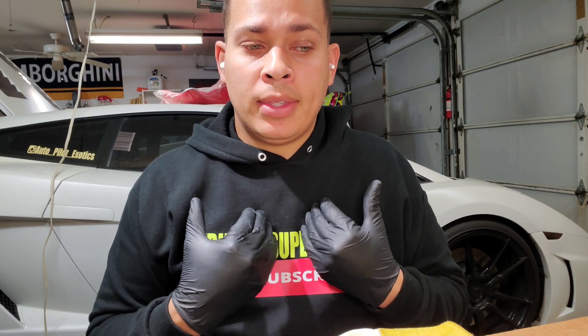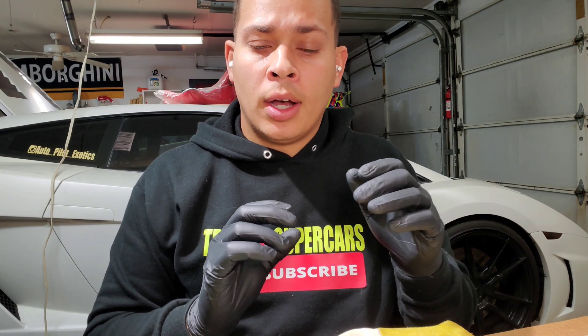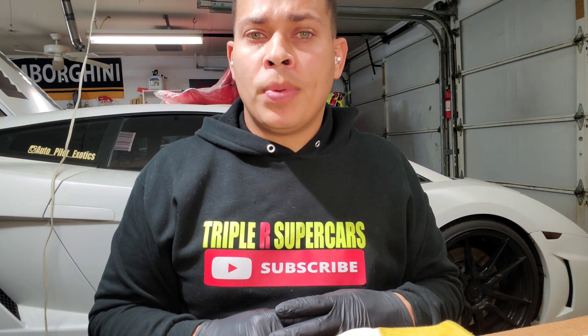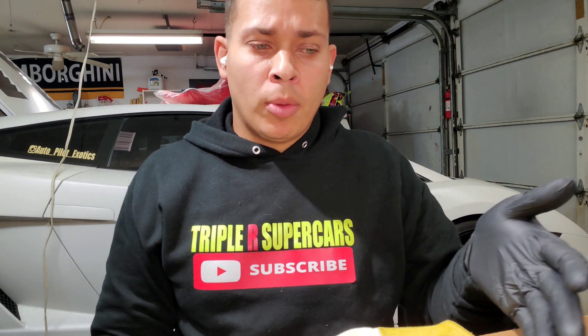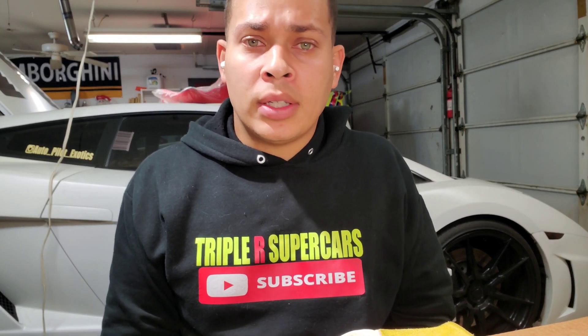And there you have it — that is my method, the quickest way that I was able to discover how to get color into the welds. I fiddle around with the gas coverage and the timing on pulling the gas coverage away from the cherry red hot weld. I discovered if you wait about four seconds after it's cherry hot red and the glow goes away, then pull the coverage away, you're going to have some good results. Now, if you've been beating up around your project and the project's nice and hot, I would give it about six seconds and wait a little bit longer. The more you do this, the more you're going to feel out the appropriate time to pull away the torch to get that coverage. The gold, the purple, and the blues are the most eye candy, most appealing looking beads — that's the color that I go with and aim for.